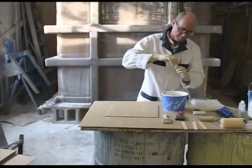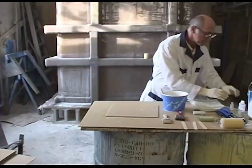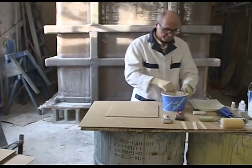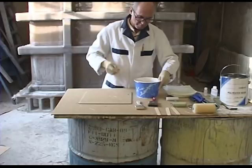Now, we won't be measuring this. This is more by our professional experience, but you see he uses the lid, and we're pouring into a 35-ounce container there. And what happens is when you mix resin, the color changes. You always turn the bucket a little bit and stir from the bottom. Always mix for about 20 or 30 seconds to make sure you've got a thorough mix.